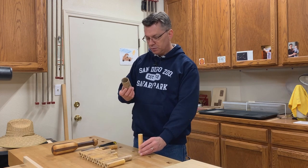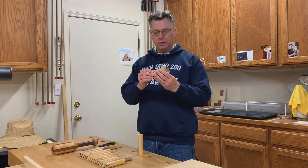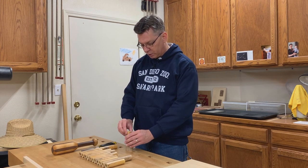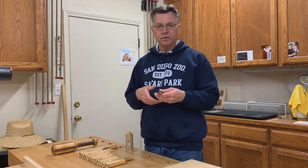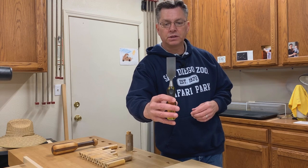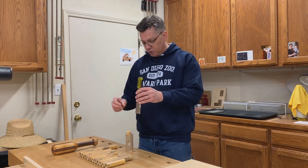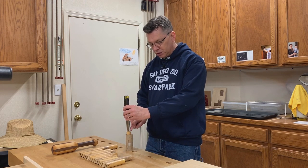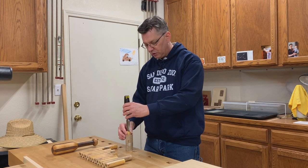I use this to hold the splits as I use my chisel. This is just a cardboard holder from a tool that I sliced to keep the quarters from going everywhere. I have a one and a quarter inch chisel, which will cover the width of any piece of bamboo that I need to split. The backside is highly polished — when you use a chisel you have to polish the backside. I use that to my advantage: I place the chisel and look at the reflection of the front half, and it makes a whole circle. When that whole circle looks symmetrical, I'm ready to split.